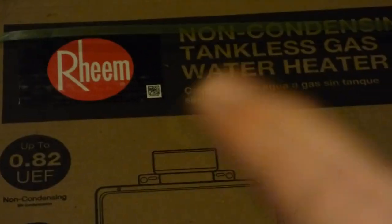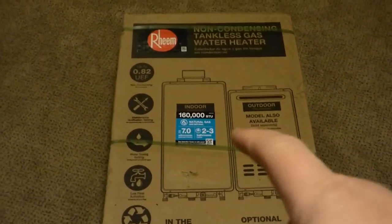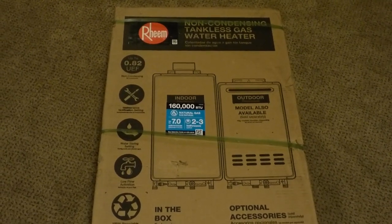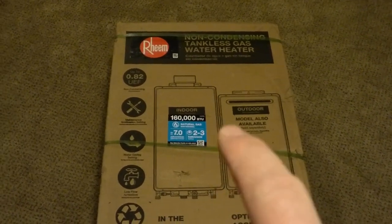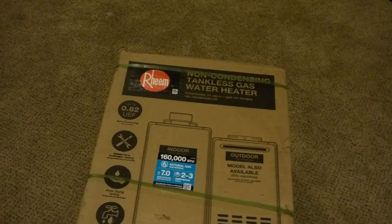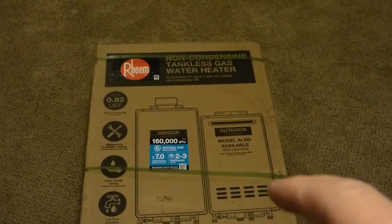When people see this 160,000 BTUs — so once upon a time I talked to a fellow about this. On your normal big round tanked hot water heaters, those usually do about 35,000 to maybe 50,000 BTU burners in them. So in theory, if you take short showers and need short bursts of hot water, this here should save you some money. But if you like to take long showers with a lot of hot water, this here might actually cost more gas in the long run.